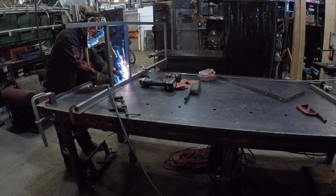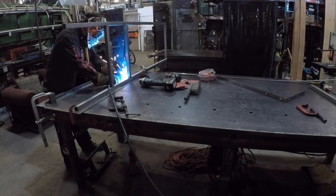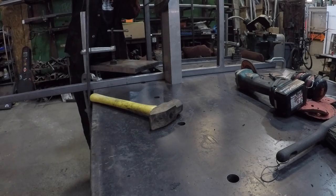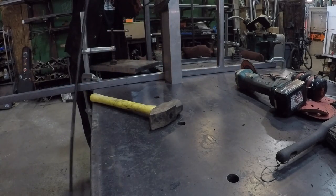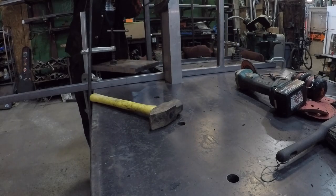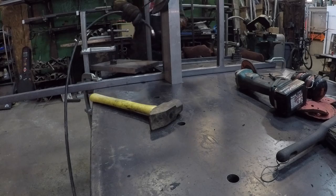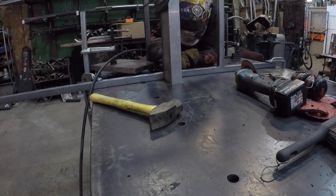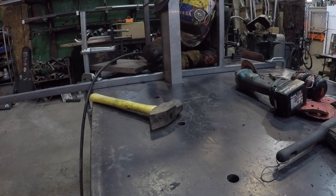Putting it together in three dimensions now. I've got the clamps for the angle iron holding it pretty square, but this is just the first couple of tack welds so it's not totally true — the back isn't quite 90 degrees to the sides yet. I've made a little improvised clamp out of my 1-2-3 block and a big random chunk of steel on a clamp to reach out across it. Only this side of the table is flat, so that's where we're working.